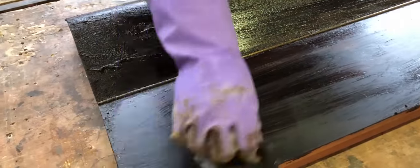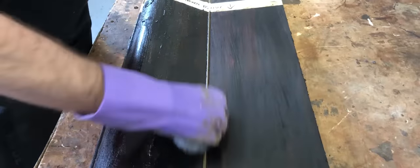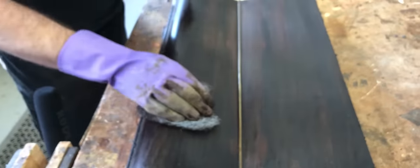And as we thought, there is rosewood. It looks quite dark, but that is rosewood under there. And the reason it's so dark still is because the piano, when it was French polished, had a scumble glaze over the top of it. It had colour added to it, and that's protected the wood from bleaching and stopped the colour from bleaching out, so it's still got its original darkness to the rosewood. It's almost like ebony, so it's part of the ebony family.